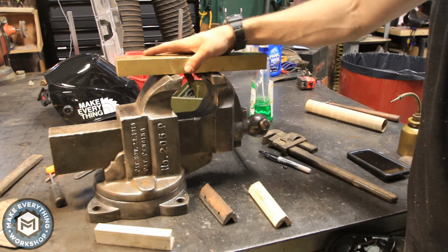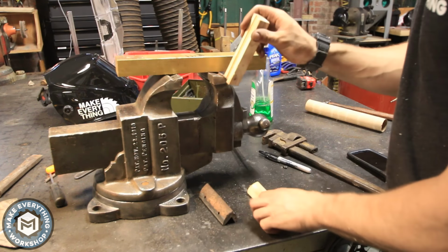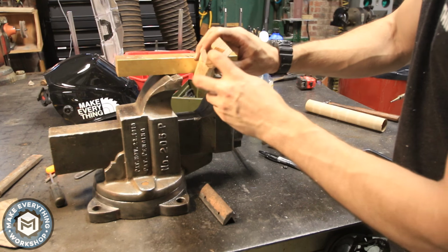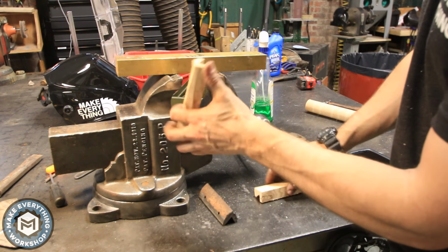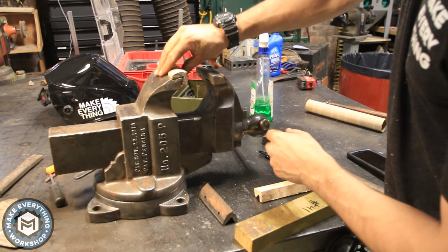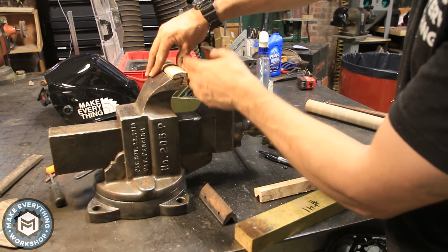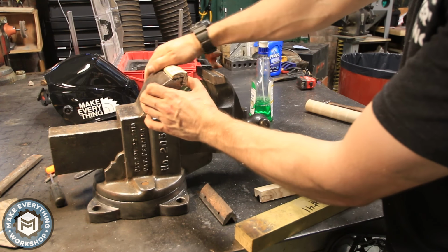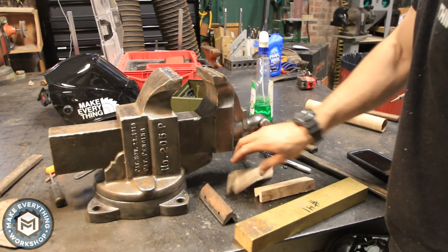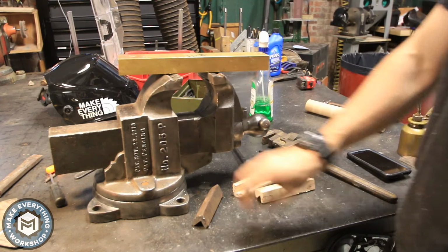This is 1.5 by 2 inch solid brass. So what I did was I took a piece of wood and I made it that exact size, and then I did the procedure that I'm planning to do on the Bridgeport on this, and this gives me my proof of concept. So basically what this wood is telling me is that I will be able to make jaws out of this, and I'm just going to have to run a pass on the mill to get them both flat with each other and do a good amount of shaping on the top, maybe with a grinding wheel, but it is going to work. So let's go ahead, take this material and turn it into these.